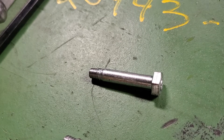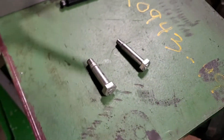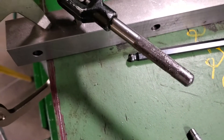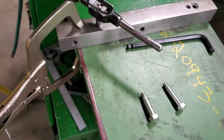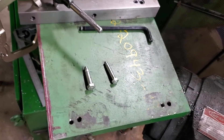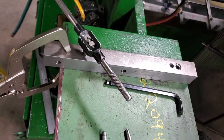I turned it so the quarter inch is on the bottom side and 5/16ths on the top. Did the same process for the 3/8ths conversion down to the 5/16ths hole. The reason you've got to go to 3/8ths is to start the tap straight. Once that's done, just take the block out of the way and finish tapping the holes — you can power tap with a cordless drill. I'm going to use this hand tap here.